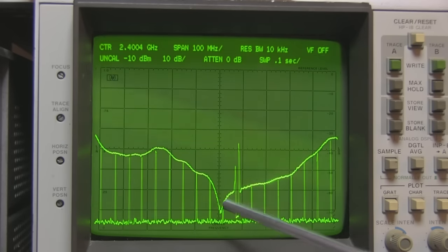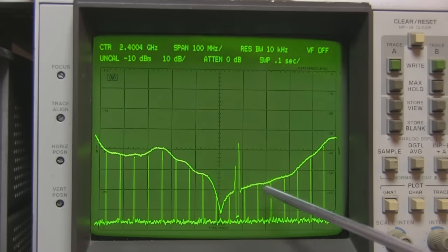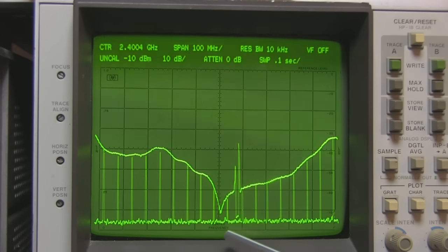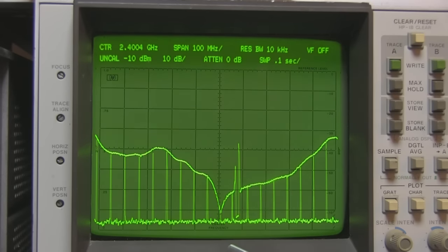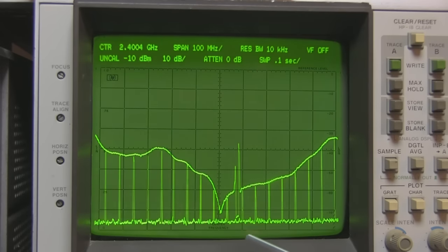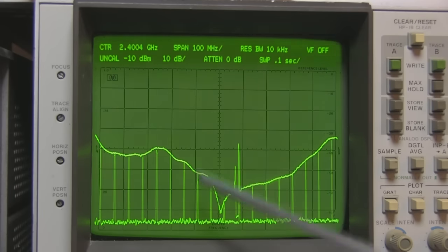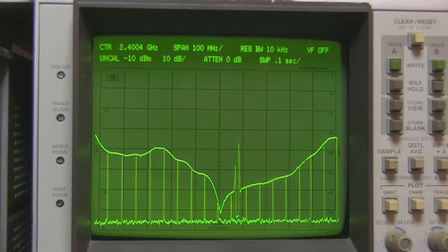I'm pleased with this little dipole antenna and how I've developed it — you can see how low it goes down so it's got a really good VSWR. The key thing now is I can move about and I'm not interfering with the signal at all, not having to keep refreshing the screen to get rid of anomalies I create by moving around. It seems like it's working fine, and I'm really pleased with the output here on the spectrum analyzer — really nice and clean.